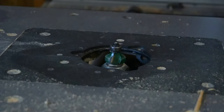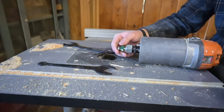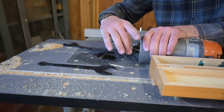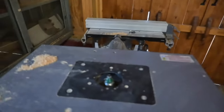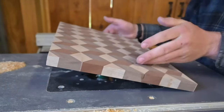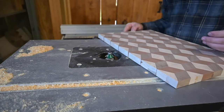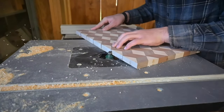I don't really feel like doing a quarter inch roundover. That's just too basic. I think a chamfer is actually going to look much nicer. The thing I love about chamfers is you can make any size chamfer up to the biggest size it can do, which is really cool. I could put my dust collection fence on, but the floor is kind of dirty already. I have them sitting up on angles, and it was really humid, so things are moving around, and they will continue to change for the rest of the time they look like cutting boards. Start there, and then we'll work up.